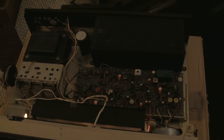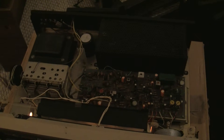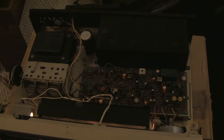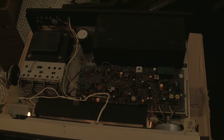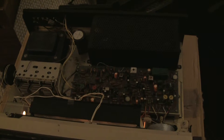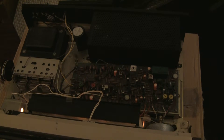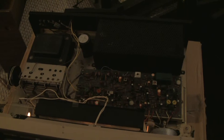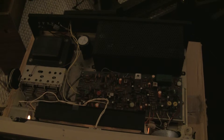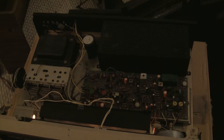There are some things about this design that could be better. I actually kind of like single supply amplifiers because if the output coupling cap can withstand the entire supply voltage, it's almost impossible for it to put DC into a speaker in the event of a severe malfunction. But Pioneer chose to use 35-volt caps with a supply that hangs around 58 volts at idle. The cap doesn't normally see more than 25 or 30 volts, but if something goes wrong it certainly could see a bit more than that.